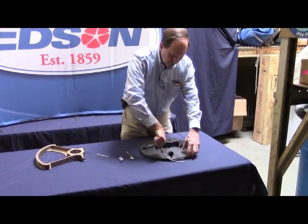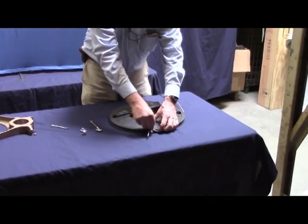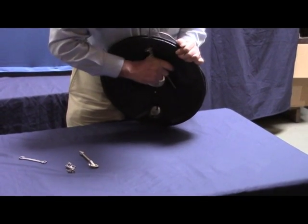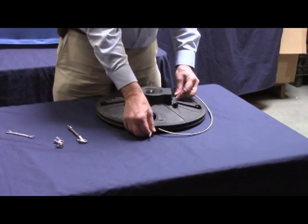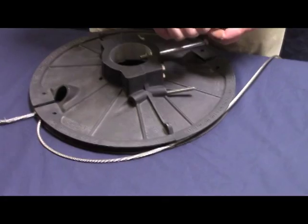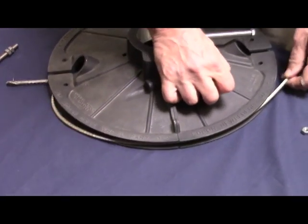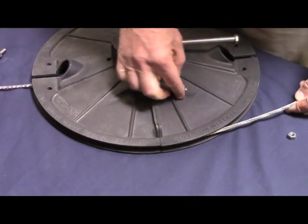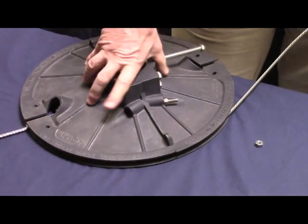With the radial drive wheel, your wires are going to go through the groove and through this opening. It's easy to do when it's not on the rudder plate, but you're going to put your wire take-up eye through this hole. What I want to do is make sure that I get the tensioning nut on there first and add just enough tension so that this wire always wants to be in the groove when it's loaded or when it's lazy.